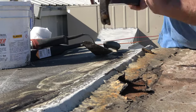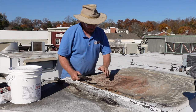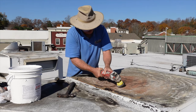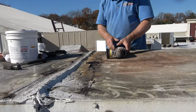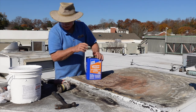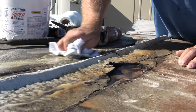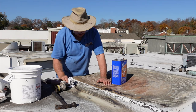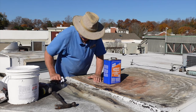I'm going to leave this tar here but make a better transition. I'll sand this off. To make double sure it's clean, I use lacquer thinners. With lacquer thinners, I can make sure the transition will be good. You can see how it takes out the mildew and crud. I always use lacquer thinners to clean a surface.